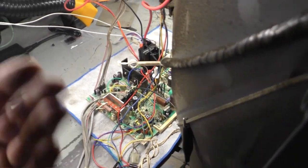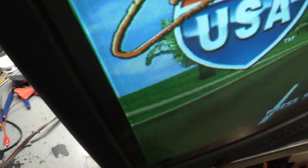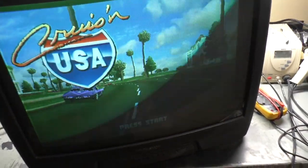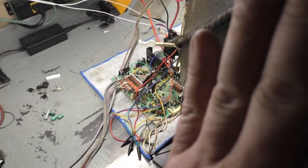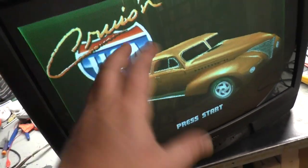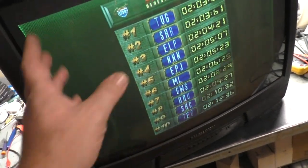But I'm rambling on here, saying the same things over and over. I've never seen a 27-inch 5000 before, and I've never worked on one on the channel, and this is something new to me. So now I'm tempted to, since we verified that the 27-inch tube makes a full screen for standard res, but medium res, we get the opposite effect. For medium res, you need the 25-inch tube, and for standard, you need the 27-inch tube.